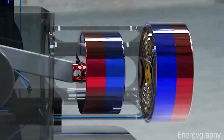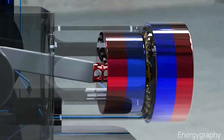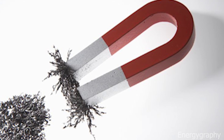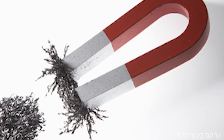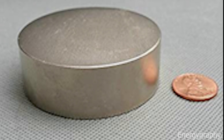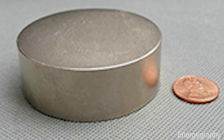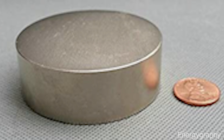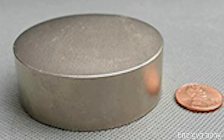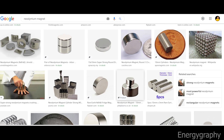But if magnets work for a long time without contact with electric magnets, their magnetic properties weaken. High temperature can also have a negative effect on maintaining the magnetic properties of permanent magnets. Samarium Cobalt magnets are very heat resistant. However, we want to use Neodymium magnets — high-grade N52 Gauss — because this magnet is very strong and can be easily bought in the market.